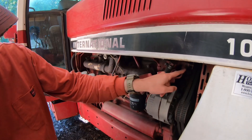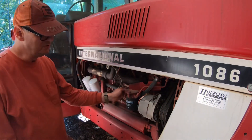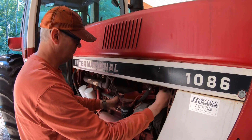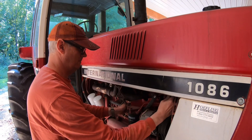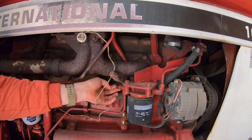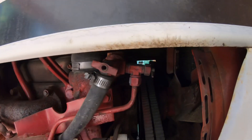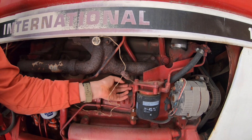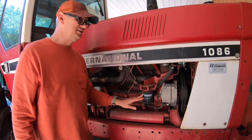The filter hooks into the cooling system down here. There are two shutoff valves — one here and one back here — and we're going to turn both off so we don't lose any antifreeze while replacing the filter. I brought pliers because I was afraid they'd be frozen up, but both turned with just finger pressure, which was nice. Shutoff valves are off, so hopefully we won't lose all the coolant when we take the filter off.